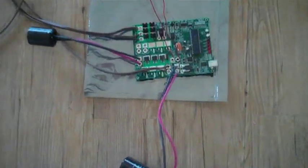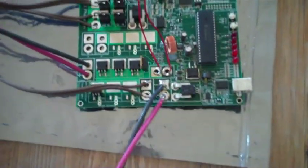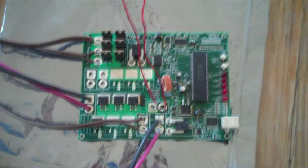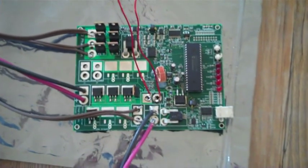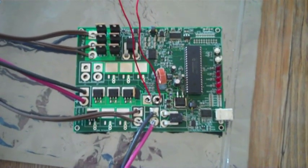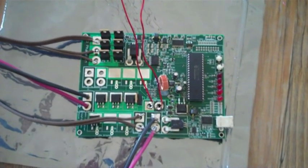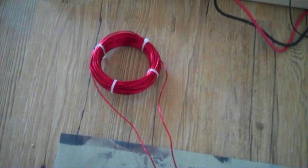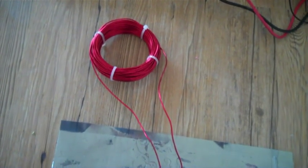This is a board I've been designing over the last few years and finally built this past year. It's a microcontroller-based turbine controller. It does peak power tracking and has a very high efficiency switching power supply that converts high voltage input to a lower voltage output but higher current. Besides being a turbine controller, this board has been designed to be a scientific instrument for characterizing wind turbines. It has the ability to measure both voltage and current in and out, has an anemometer input for wind speed, and can also measure turbine RPMs.